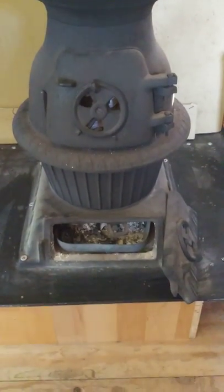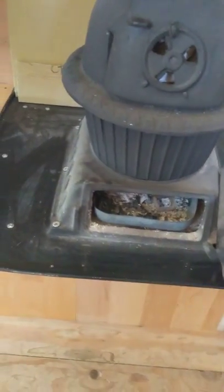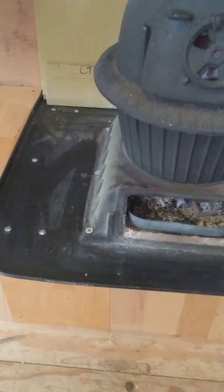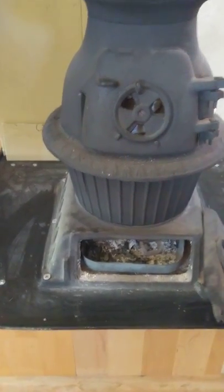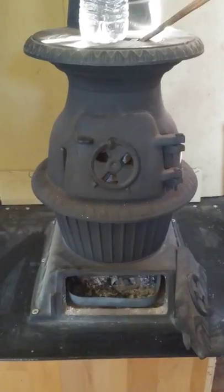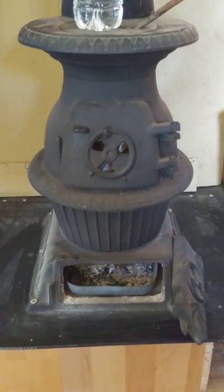A couple of things about this stove when it comes to putting it in a bus. The first thing I did is I took the legs off. These things are made out of cast iron, and the legs are screwed on, usually with little bolts. They're going to rattle loose going down the road, and this thing comes falling down — or even worse, later that night, a leg falls out from under it and scatters fire on the floor. So you want to bolt it down.